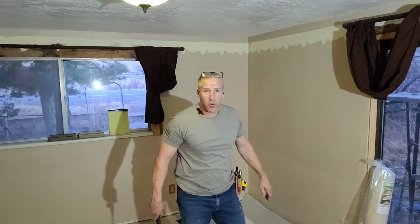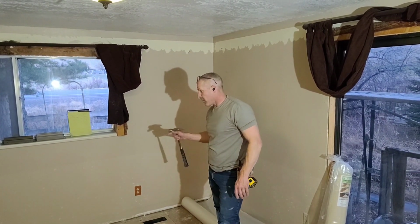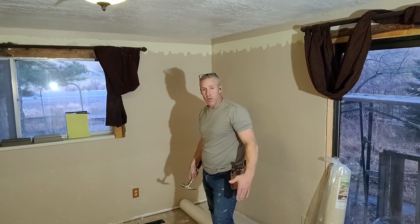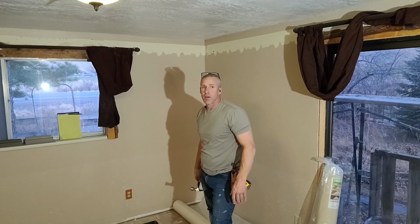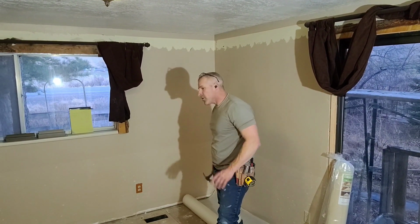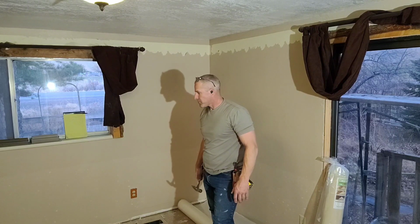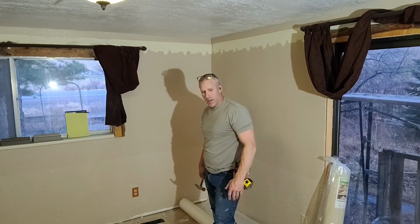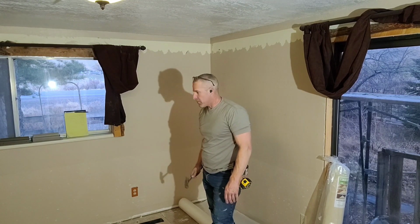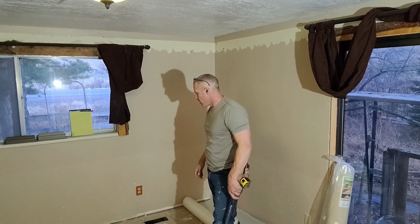Okay, I'm gonna get some pad rolled out, and I got my layout figured out. I'm actually gonna start with the full plank on this side of the room, and on the other side, I'm gonna end up maybe trimming a tiny bit off. I don't usually like to cut it that close when I'm laying it out, but I think I'll be fine cutting just a little bit off. I can space this over here 1/4 inch, and then we're gonna put some 1/2 inch or 5/8 base on top.